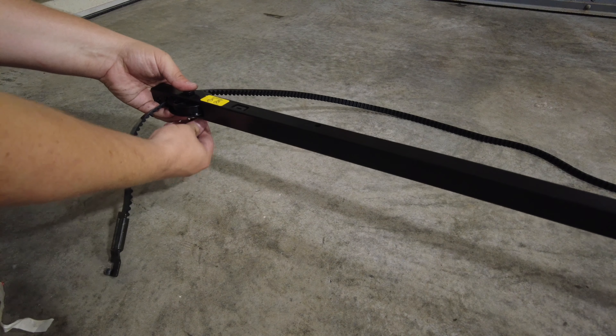You may need to change out the bracket on the other end of the rail depending on what model you're coming from and going to — just make sure to swap it out for the correct one. At this point, to complete the installation you just reverse the steps you took to remove the old opener. Make sure everything is in place to fully support the garage door opener as you lift it up, and get help if you need it. Your installation process could vary depending on your specific environment, so read all the instructions in the manual to make sure everything is installed properly.